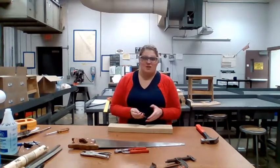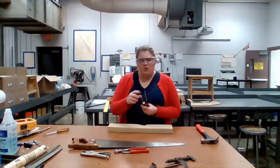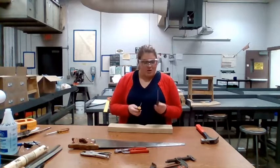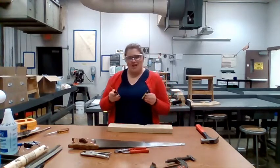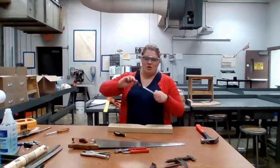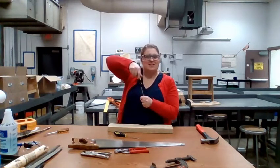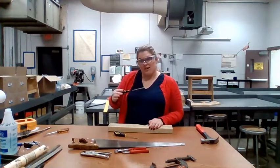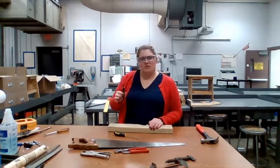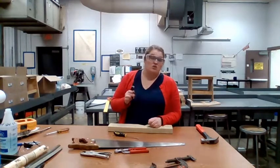If your screw gets damaged and it is stripped, then you can't back it out of the wood, and that's a problem. If you are using the right size, it's going to get a good grip in there and go ahead and turn it. Also, and I'm guilty of this as well, screwdrivers are meant for taking a force that's turning. That's the way they are supposed to take the resistance. Using a screwdriver as a prying mechanism, like taking paint can lids off, things of that nature, is not what they're made for, and they're not rated to do this. So that's actually a really good way to bend or break your screwdriver.